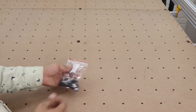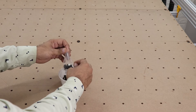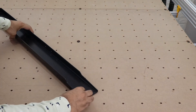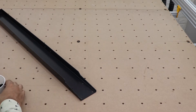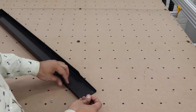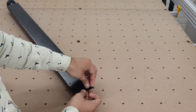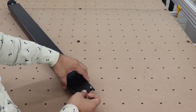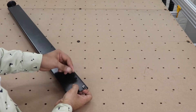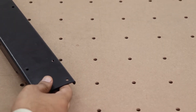Find the hardware bag in the kit. We use white storage bins that are great for organizing small parts. Take the M5 8mm bolts and T-nuts, and install T-nut with bolt into all four leg holes. Make sure the T-nut remains loose for movement, and also make sure the leg is oriented in the correct way. Repeat the previous steps for all three remaining legs.